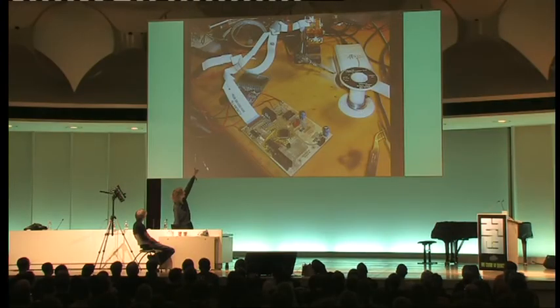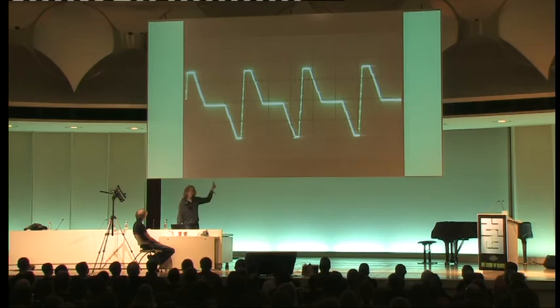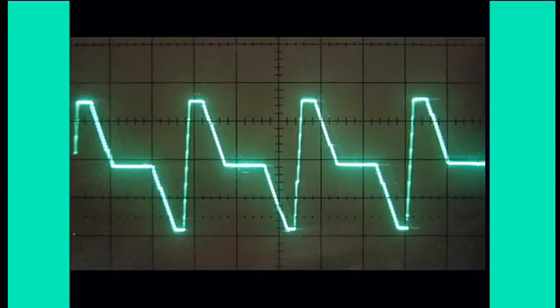There's also a development board doing PID temperature control of the printhead block, keeping it at a flat 70 degrees. Here's the magic waveform coming out of my device — I copied all the timing from the Epson hardware by looking at it on an oscilloscope. The sharp rise that actually causes the physical expulsion of ink is about a microsecond — a quite high-speed situation. And it works, which is pretty cool.